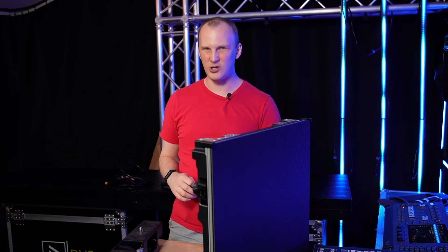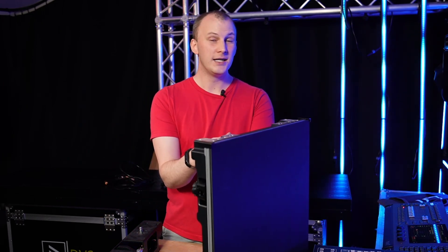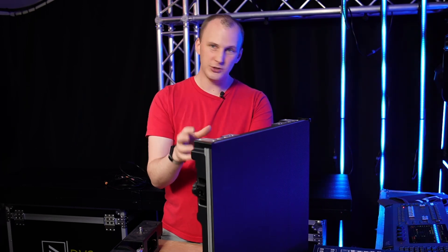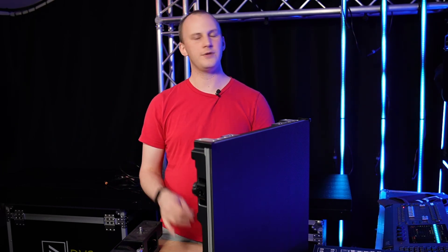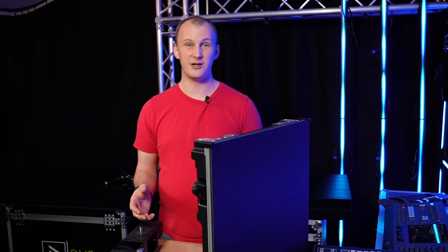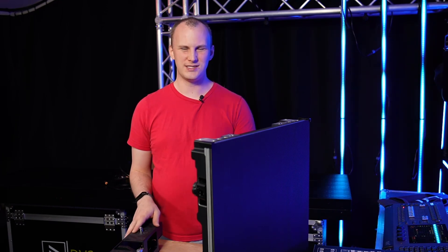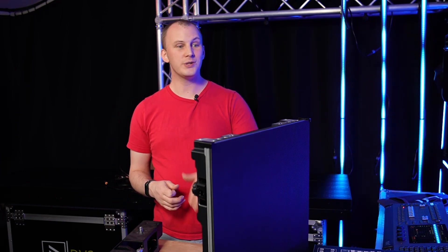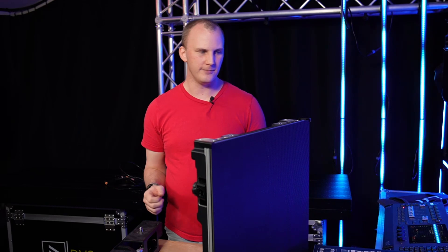We've got some packages on our site now that allow you to get a lyric banner that's actually nicer than that competitor for about the same cost. What you're going to need, assuming we're hanging it, is LED wall panels. This one's the DVS Visra. If we're doing just the exact same lyric banner as that popular company, we're going to do six panels. We also have another really awesome wall company called Creation LED that has a very similar LED wall panel in a package we can sell and ship for around the same cost, but we're doing 2.8 millimeter instead of 3.9, so for the people in the front rows it's going to look a whole lot better.